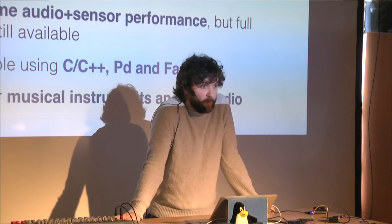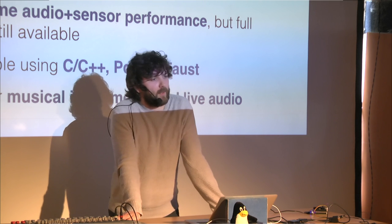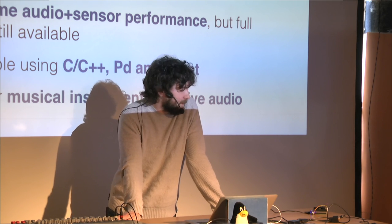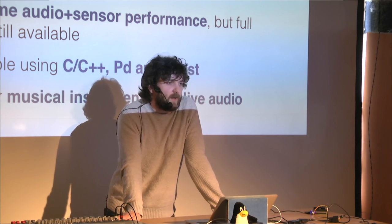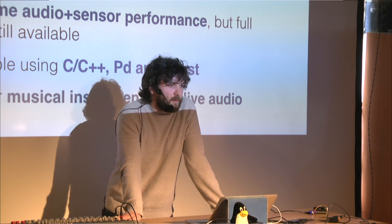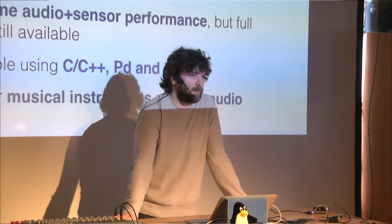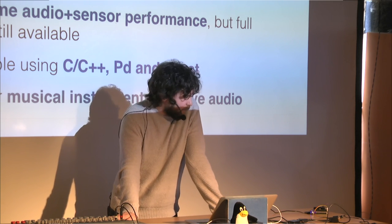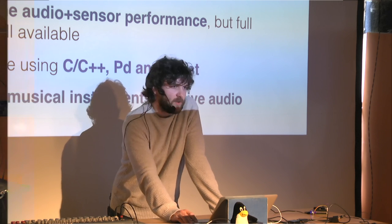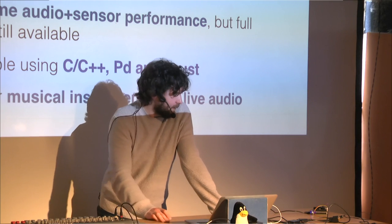The analog inputs and outputs are sampled at 22 kHz, which is quite remarkable — you can do audio-rate I/O with them. You probably wouldn't use them in the main audio path, but you might use them for side-chain compression, trigger inputs from a piezo, or getting 22 kHz sampling from an accelerometer to properly filter the data. These are synced to the audio clock, so they're aligned. There are also 16 onboard GPIOs used for digital inputs and outputs.